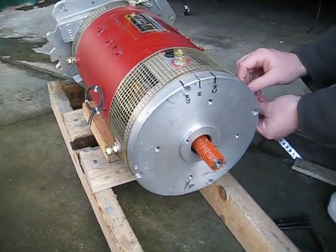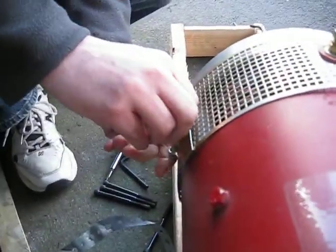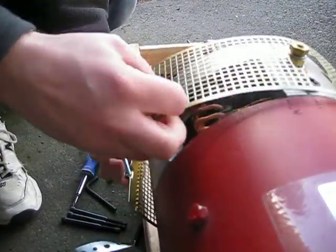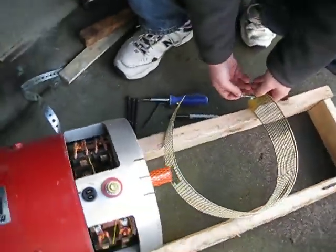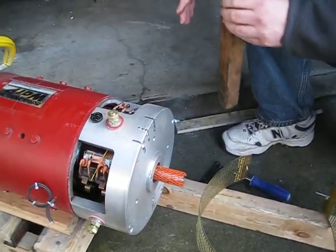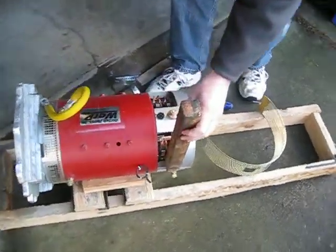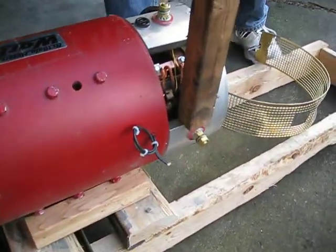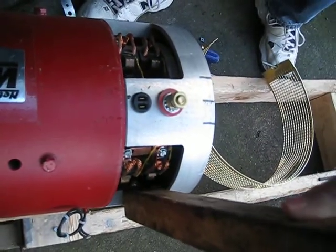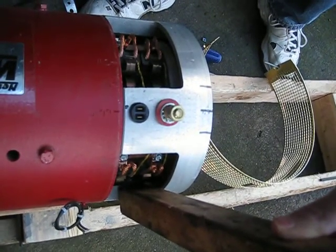Take those bolts out and take off the wire casing — easier said than done. This is a rock guard; keeps stuff from getting in. Then we're going to use a piece of wood and a three-pound hammer, put it on the big part of the casing, and start tapping it to slide it. You can see it starts sliding to the counter-clockwise position, and I'm gently knocking it so it won't break anything.